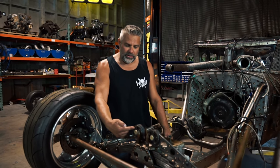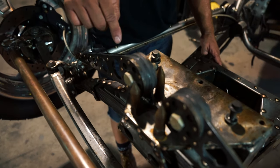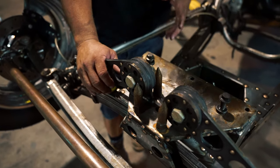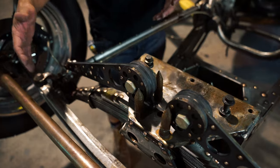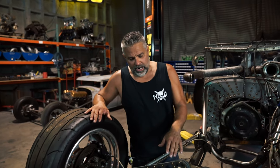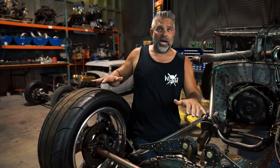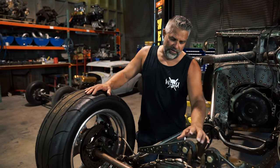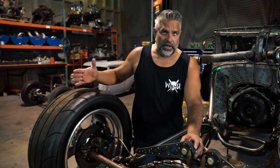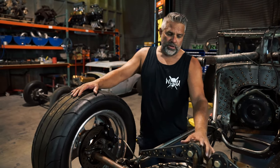The way this works is there is a plate, a friction material, then another plate, another piece of friction material, and then the mounting bracket that actually welds to the front of the car. When you're going down the road, the front end is traveling and without a torsion shock you're going to get a lot of hop. This is kind of an old-school setup — there are a lot of different kinds of torsion shocks, even late model cars have a torsion shock setup now.